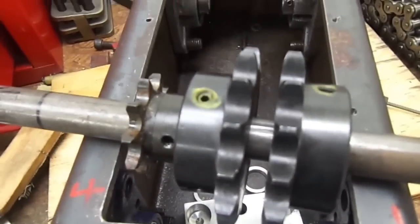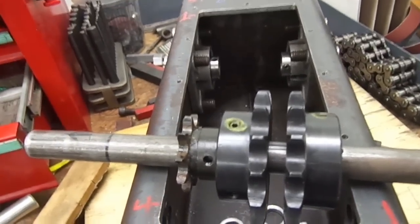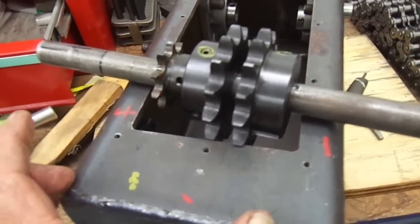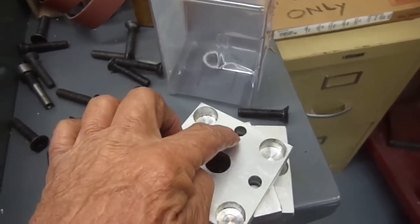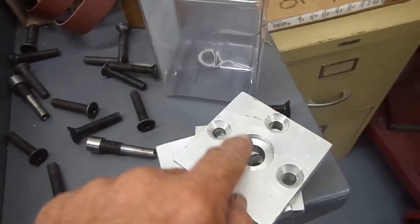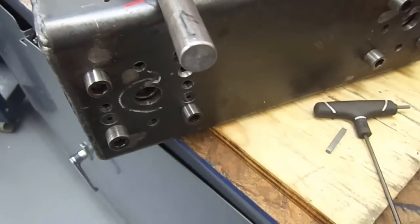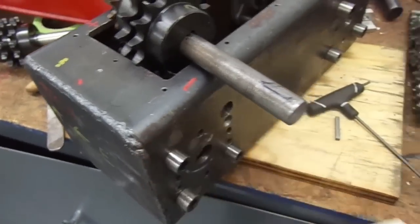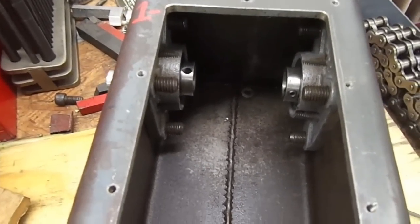I think that I'm going to go ahead and build it this way and not worry about it. I'll run it until something happens. I'll come up with a better design gear transfer case. All I need is a 4-inch box. And you know how I put this over that, but I'm going to probably have this a little bit thicker, make these same blocks, have them a little thicker. But I'll machine and groove out my bearing to fit in here. Then I'll machine and groove out for my seal. So when that goes on it, all that'll be left is a shaft in there. So you can just pull this shaft in and out and put this bearing housing on the end of it. That's the way I should have done it to start with, but I was going to make a dry box. And I went ahead and bought these bearings, so that's how it ended up the way it did.